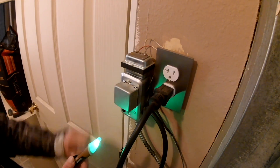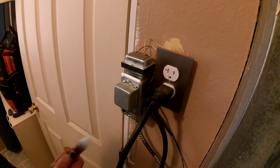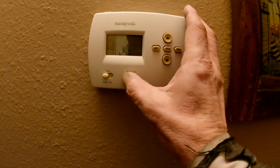Got power going to the fuse box. The next thing we need to do is reset the thermostat. We need to turn that thing all the way off because we cut power going to the furnace. To reset it, we have to go to the thermostat and reset that. After a few minutes, your furnace will fire up.